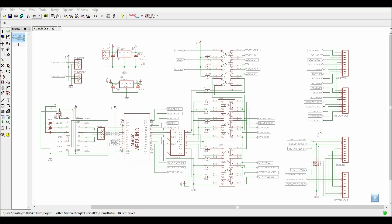And similarly, what I'd then do is I'd drive a serial out through a 74595, and I'd drive again, these being optocouplers, so you can effectively look at these as an LED matrix. So again, I've got two columns by 3 rows coming out here, feeding through to the optical transistor on the other side, and again feeding it back out as column 1, column 2, row 1, row 2, row 3. Those getting pushed to there, and there'll be a cable then from my controller board to the coffee machine controller board, which would just then simulate the button presses as it goes.